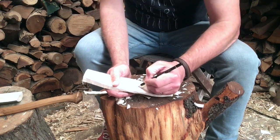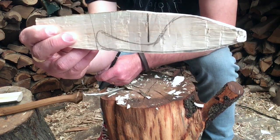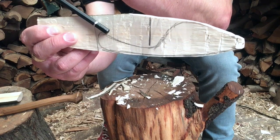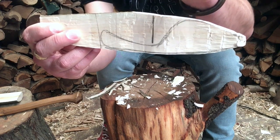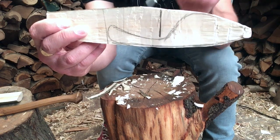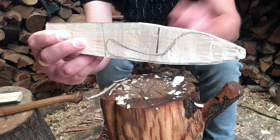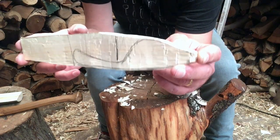I'm just going to draw the line — you don't have to, this is just to show you where it's going. Just down to the lowest point. I've not gone right to the bottom because if you come down in a straight line, you need to keep that nice little curve in there. If you put the curve in and you've gone too far, you lose extra material. So stop about a millimeter short, and by the time you've got the curve in you can still stick to that line. I'm going to use the saw to be nice and quick. Now we've got a saw cut in place and I'm ready to start cutting with the axe.